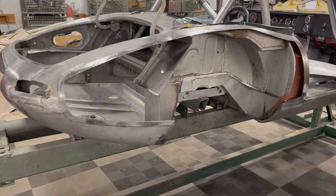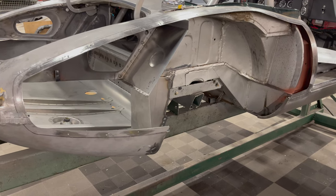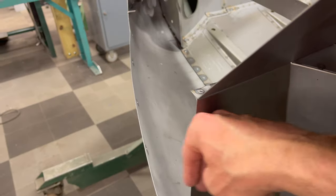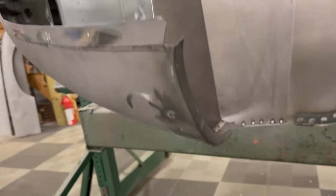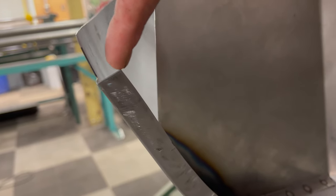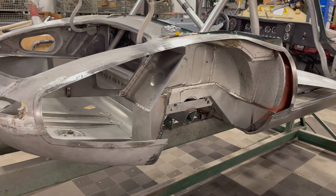The wing fitting is all done on this side. All I've got to do now is a final little bit of smoothing on this wing, and then I've got to build inner pieces that mate to these sections. Here's what we've got on the bottom — it's all dressed up now, looks nice, and it's just pulled out a little bit, maybe a half inch at the top. You can see the little weld mark right there, and out here it's out just about half an inch. Now we've got to do the other side.